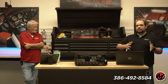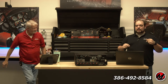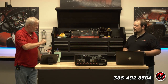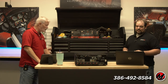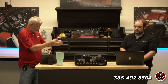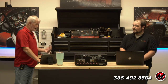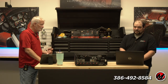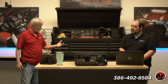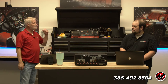The main way DACs work is based on sampling. When a digital signal comes in, the sample rate may be very high. You can go out and buy a standalone DAC for several thousand dollars — how do you get from a $20 one to a $2,000 one? It's much like the $440 to $850 AVR change: the better the power supply, the more information can be processed, and once you get to the analog section that's where the dollars really start coming in — because analog is not cheap to build well.